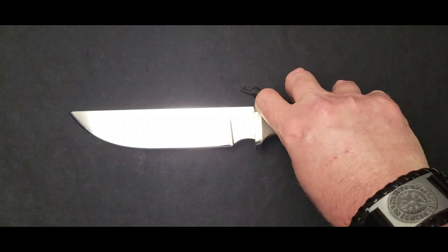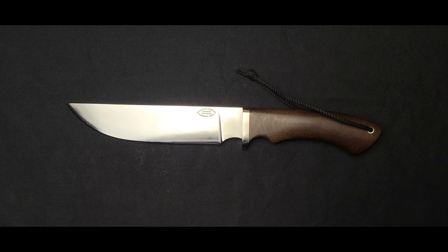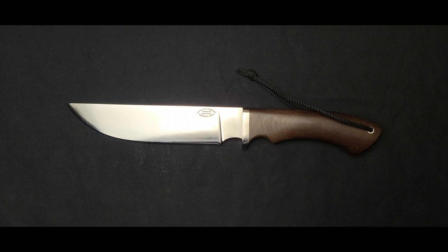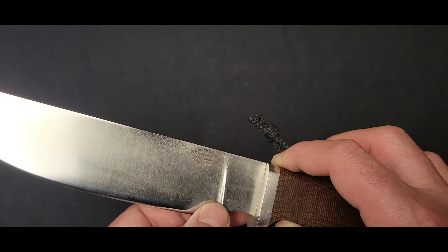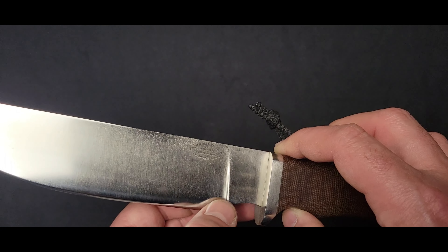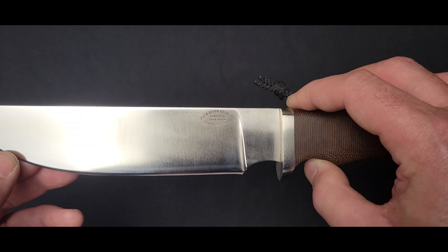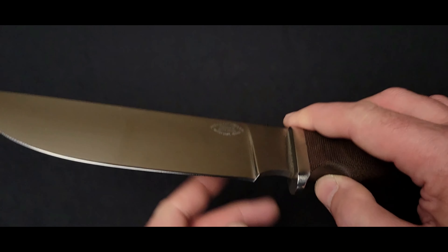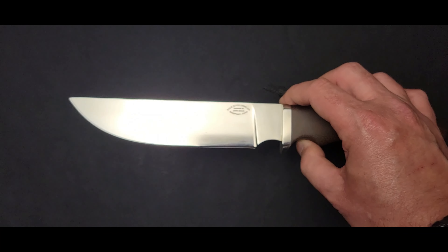Now we move to the plunge grind. The plunge grind is the transitional point between the flat of your blade and your bevel. Pretty much every knife has a plunge grind in one form or another. Sometimes they're in very elegant, sweeping lines; sometimes they are in very hard, abrupt angles. Most are like this, where it is a subtly rounded junction. It's better to be round — it removes stress from the blade. Hard right angles are often bad, being a stress point in a blade. You always want to make sure they line up from side to side and that they are even — that's signs the knife was done well.